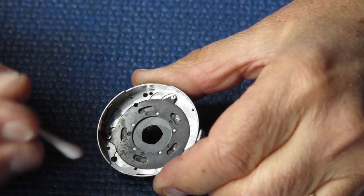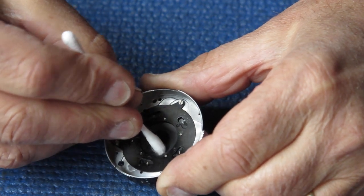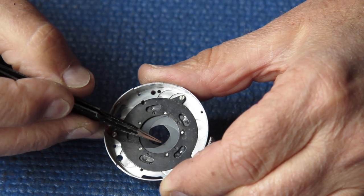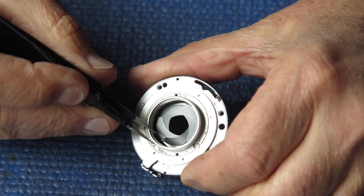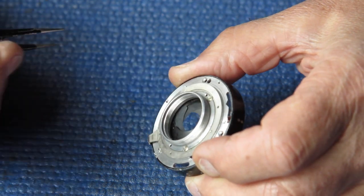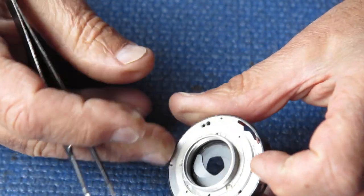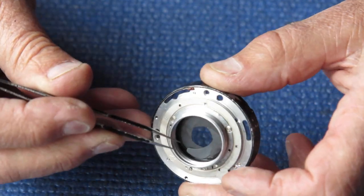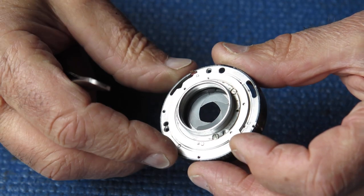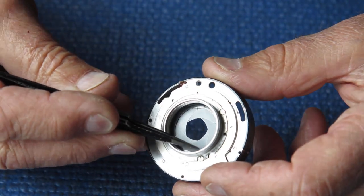Now I'll show you how to go about breaking the diaphragm while you're cleaning it. Typically what happens is that while busy cleaning in a circular motion with your cotton bud, you press slightly too hard on the blade. And it wasn't the blade I was pressing on that got displaced - it was the one behind it. And you can probably see that blade is pressed out of place. Now that one just dropped back, but the blade next to it has popped out completely - the end of that blade, instead of being tucked down inside, is now riding on the outside. If at this stage you move the lever further across, things will start to get really messed up.